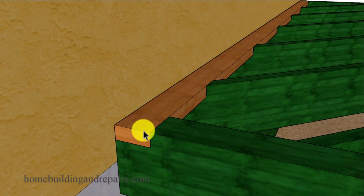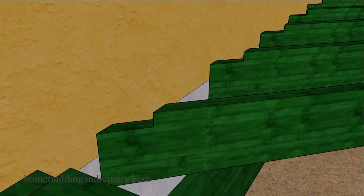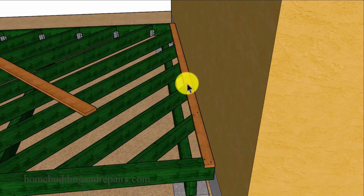I went ahead and made this construction standard lumber. However, you can use treated lumber if you need to, and these joists don't need to be treated lumber for every deck building project. However, I do understand that some areas where it snows a lot or you get a lot of moisture might need to build the entire deck out of treated materials. So again, you can see here where the notches need to be so that we can install our 2x4.